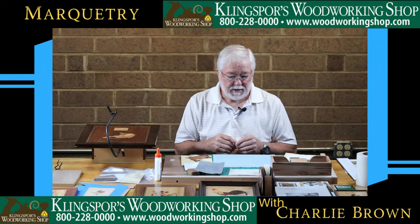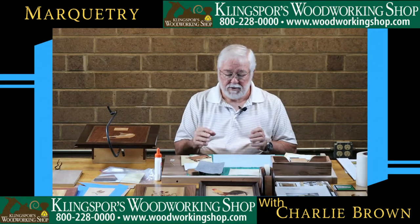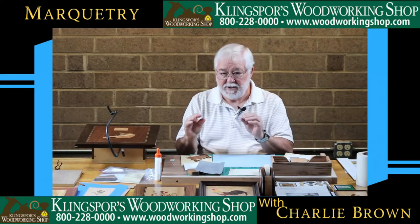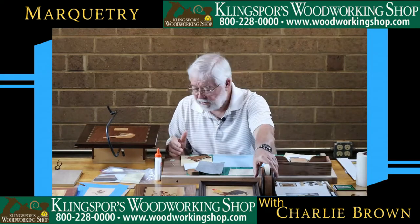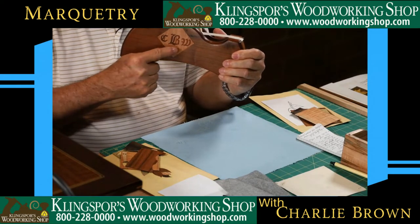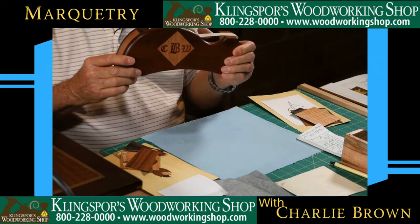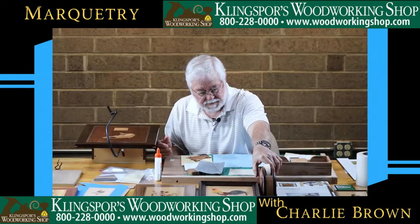Inlay is another term that is used a lot with marquetry, but it's two different processes. Marquetry is creating the piece in a thin piece of veneer. Inlay is when you take that or other items and you sink it into a surface. For instance, this tape dispenser. The diamond piece here with the lettering is marquetry. The process to put it into the tape dispenser is inlay. So that's the definition.